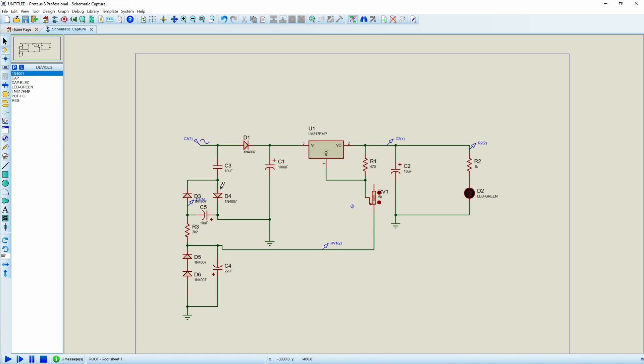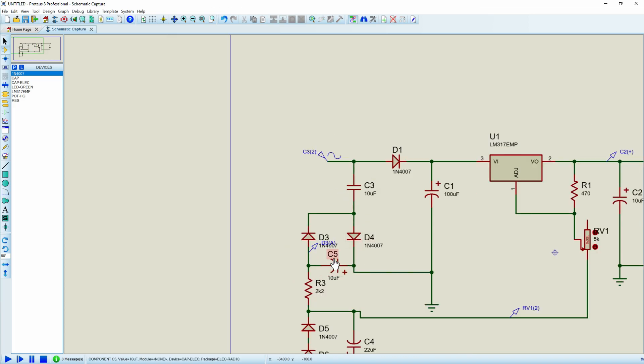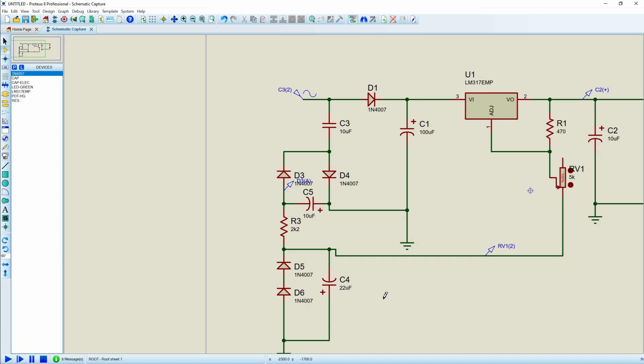...it does take time to charge up as it goes through the capacitor. If you work out the reactive capacitance, it does actually take some time to charge up both capacitors in sequence. We're suppressing that output voltage, so when you first turn it on, it's going to spike up about 1.2 volts or so, and that can be a problem. When you turn it off, there's the same issue — the capacitors discharge, the voltage rises slightly for a moment, then falls. As long as you're aware of that and don't have anything too sensitive, it's not a problem.